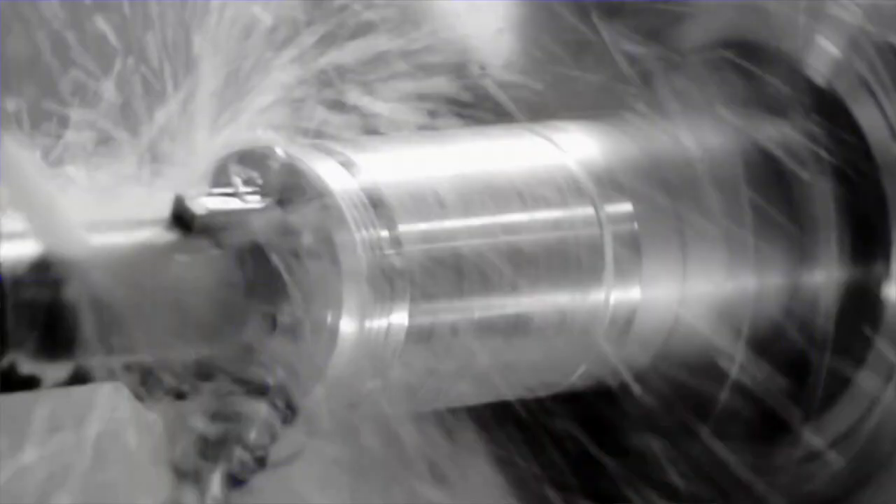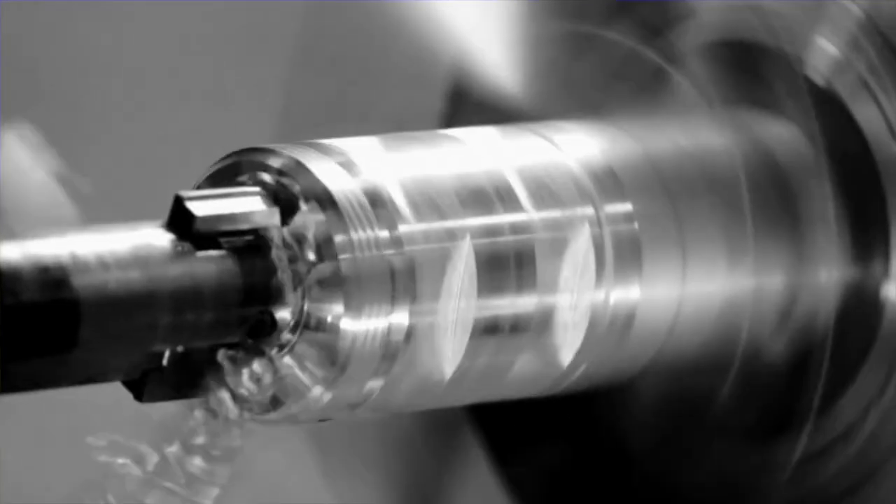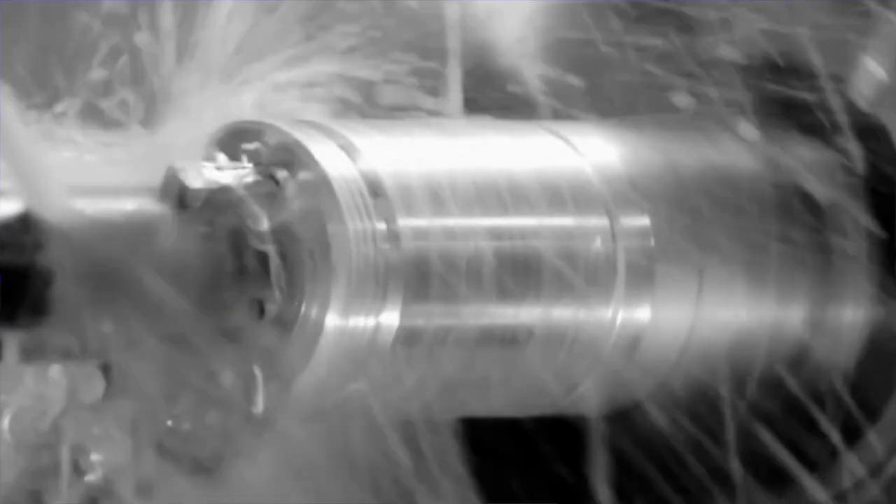I'm glad you're here today. Machining a metal part with tight tolerances is a very good idea in low volumes, but perhaps your volumes are picking up, the prototype has been proven, the market is expanding, and all of a sudden you're faced with machining thousands of parts with very delicate features and your manufacturing group is overwhelmed. By molding the parts with metal injection molding, you can reduce a cost and reduce the headache of having to reproduce a machined part.